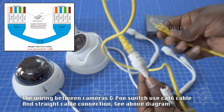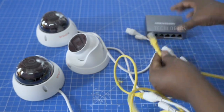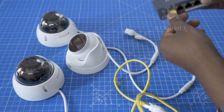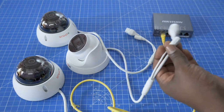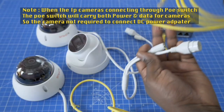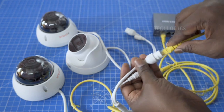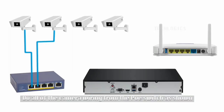So this is basically how you do it. I have my crimped cable already purchased from the market. I'm going to connect it to my power over ethernet switch, which means I do not have to connect power to the camera. Once I've connected the power over ethernet cable to the camera from the switch, I don't need to buy an adapter for the cameras. But if I'm not using a power over ethernet switch, I'll definitely have to buy a power adapter for each camera. So it's best advisable that you use a power over ethernet switch.